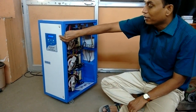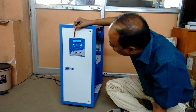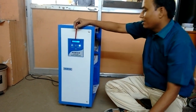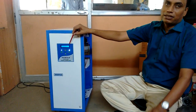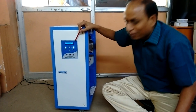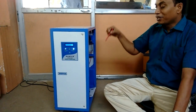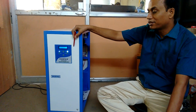That's the controller — it shows what voltage is available. This is called the output voltage, what it is now delivering to the load. Each phase gives phase-to-phase and individual phase voltages. That means the minimum voltage — in this case, this stabilizer operates from 160 to 270 volts.